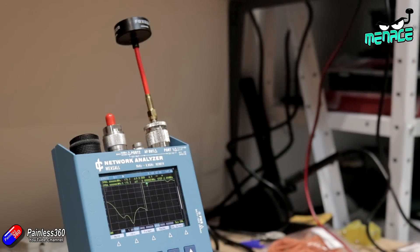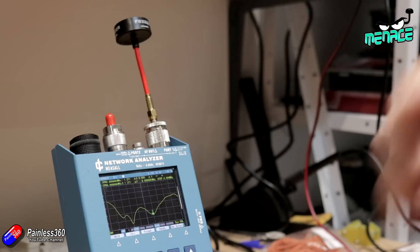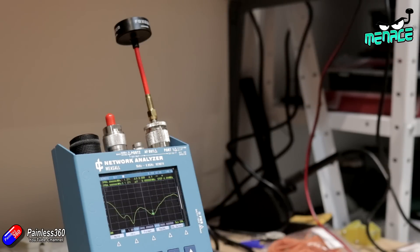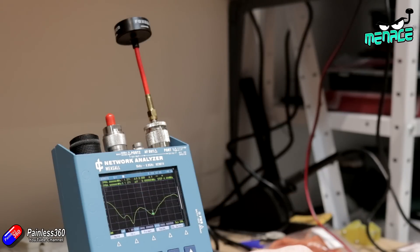Let me hand over to Greg at Menace who will go through the test. We'll pop the Fox here on the antenna and run it. So here we've got — we'll work with this dip at 5.986 gigahertz because that's the closest to our 5.8 gigahertz — we've got a 1.27 VSWR. We will hold that waveform so we can use it as a baseline to compare the others, and then save it.